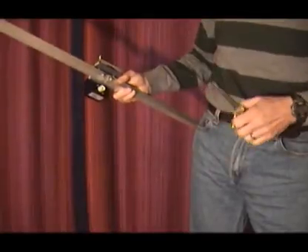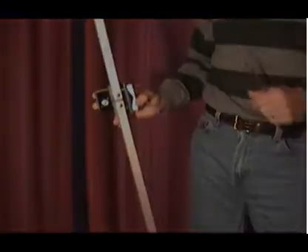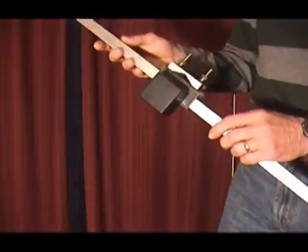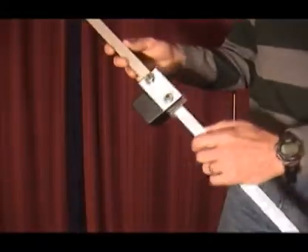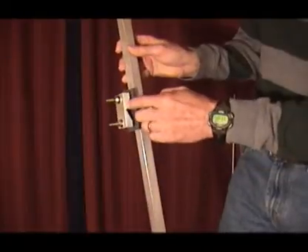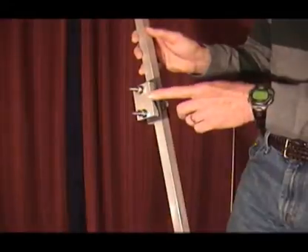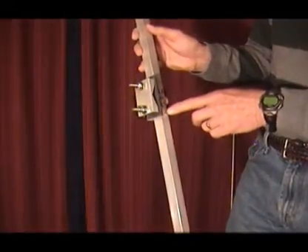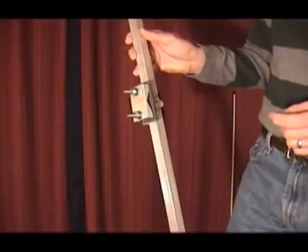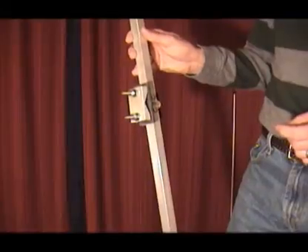Now we'll go on to inserting the five-sixteenths tubes into the antenna. As an aside, when you're shopping for an omni antenna, there are some very important features you want to look for. You'll notice this is a fiberglass angle, and it isolates the mast — which mounts through here — from the antenna itself. That's very important, because if the mast is electrically connected to the antenna, the mast could very well radiate. The length of the mast will determine how much current it draws, but it's going to be wasted power in the vertical field, and it will distort the pattern of the antenna.